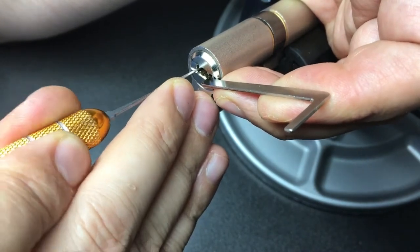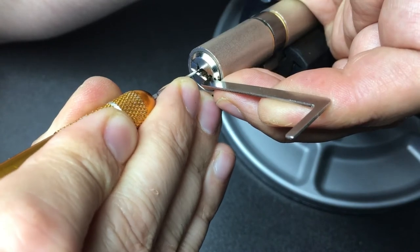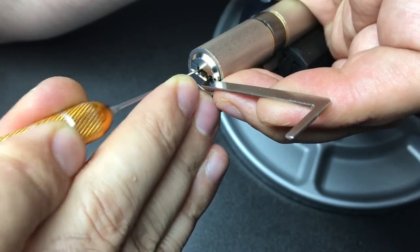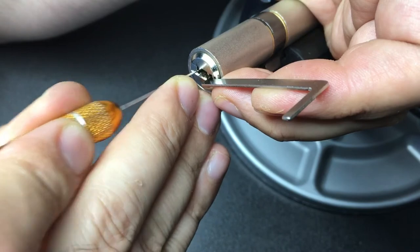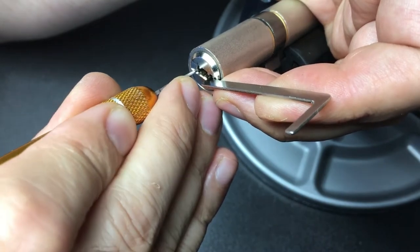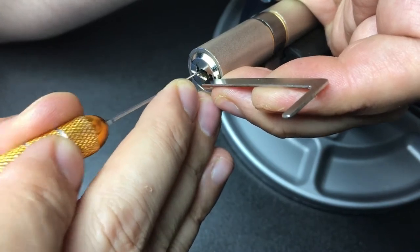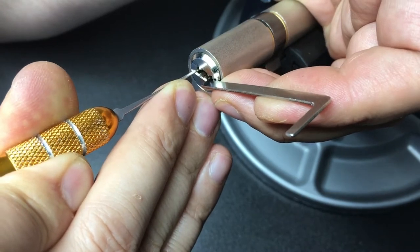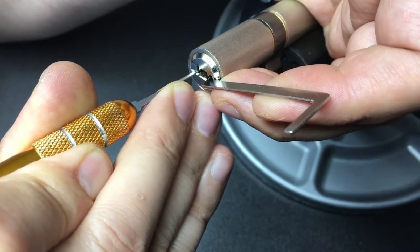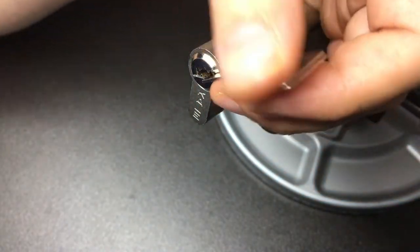Something's popped up so I'm going to release the tension a little bit. There we go — I must have overset two, or some of the pins at the back. Five and six just need setting back. Pin one, pin two, three — there again. Let's try again — counter-rotation, we got it again, but had to hit three. There we go — got it that time. Pin four, counter-rotation again, got it but dropped a pin. Hit three and we're open.